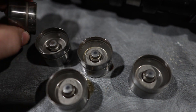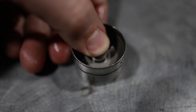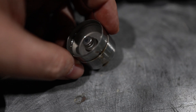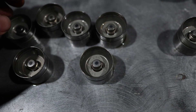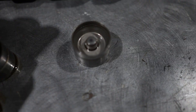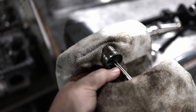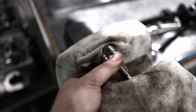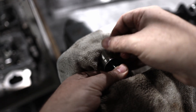So I noticed that this one here, no matter what I did, I couldn't get it to collapse. This particular one had been in all of the failures. All the rest of them were okay and squishy, but this one - no matter what I did - I couldn't get it to work. So I put it in a vise just to see if any of them would collapse. All the others collapse - you can watch the plunger go in. But when I put this one in, that thing is rock solid. It will not go in whatsoever.